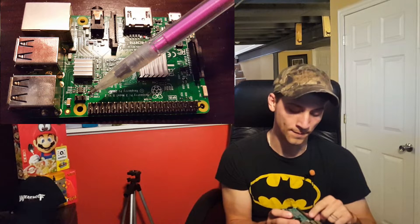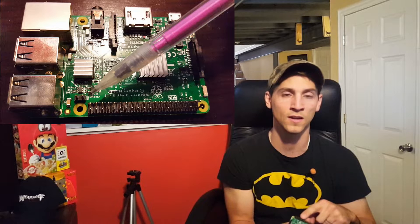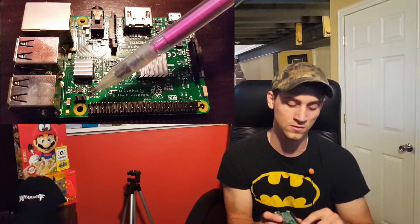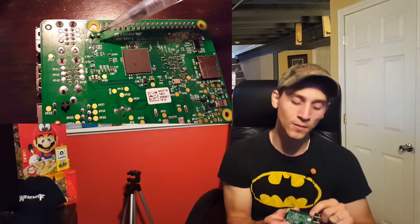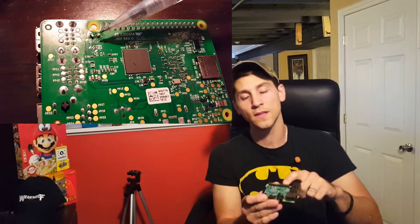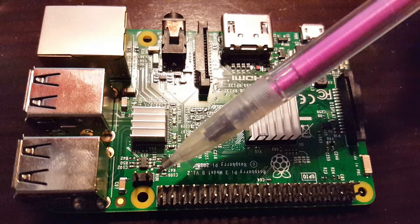Since I'm kind of a nerd, I have a ton of old computer parts. What I did is I clipped out two little metal prongs — the kind found on every computer motherboard for connecting USB, fan plugs, power headers, and so on. If you have an old non-working computer you can just clip a few off. I soldered them into the RUN header, then added a little plastic divider and stabilizer in between. I'll have close-up pictures in the corner of the video so you can see exactly what it looks like.